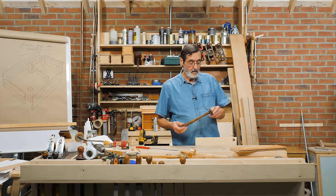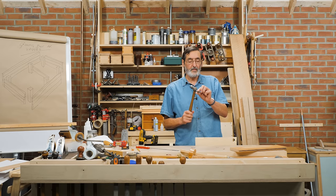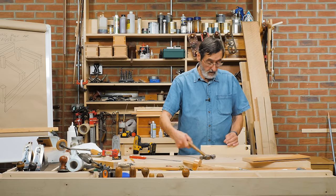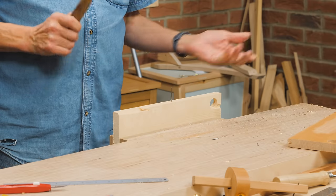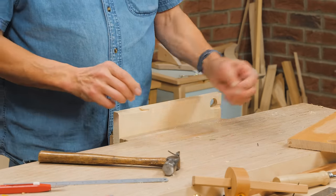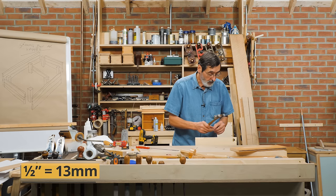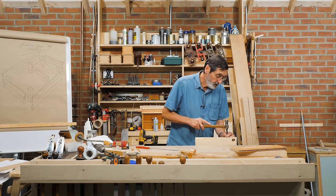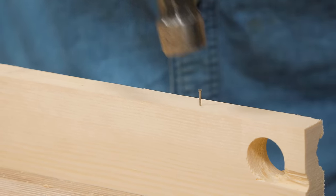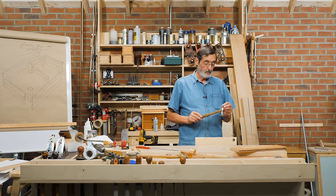This is one of my favorite hammers — I've been using one for years — and people often ask me what the purpose of this flat square edge at the top is. When you're driving a big nail you hold it between your fingers and just use the one face, no problem. But when you get to these little rinky-dink nails half an inch or less and you've got big fingers, you put the pin right between your fingers and use the hammer like that just to start it, then you flip it over. It's just to start the nail — that's the only reason for it.